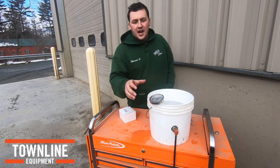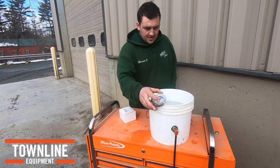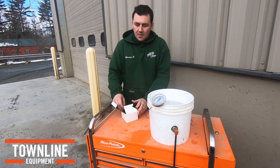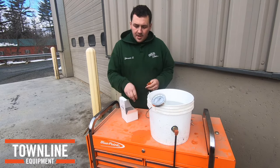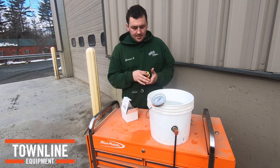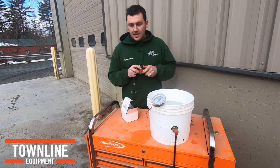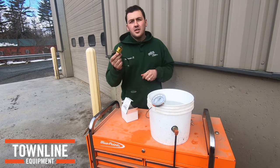So it's been about half an hour, and our pail has increased by 10 degrees. A block heater is a really simple option to have on your equipment to help assist in winter startup. There's a bung like this, and a cord that adapts it right to wall power, and then this next clip, you're gonna see this get installed in the engine wall.